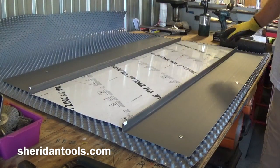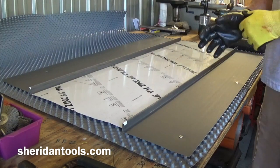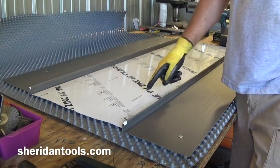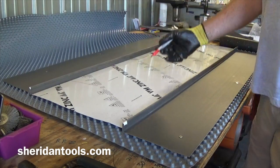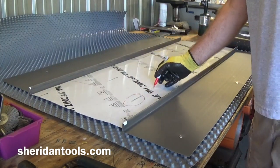First thing you have to accommodate when you're doing a panel repair is, before the roof installation is complete, you want to make a note of the rolling direction of the panels. Rolling direction is on the plastic. Okay, these panels are rolling this way.